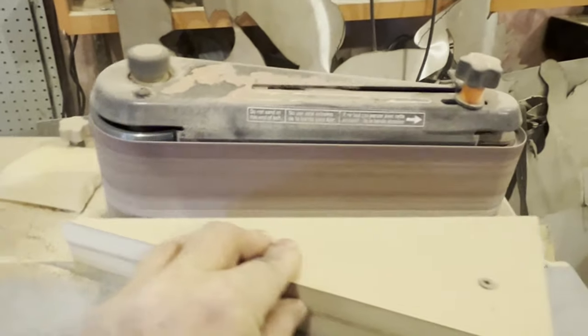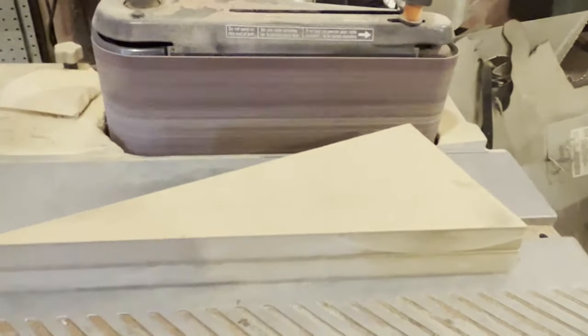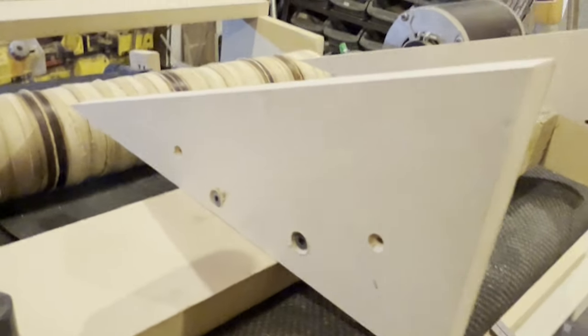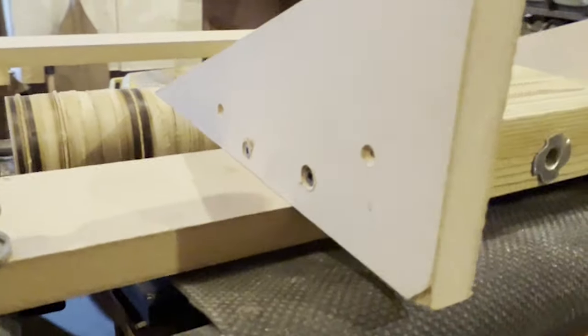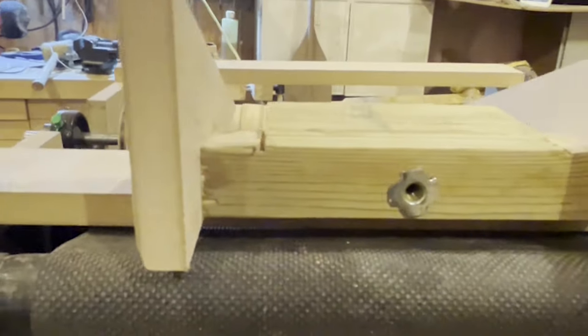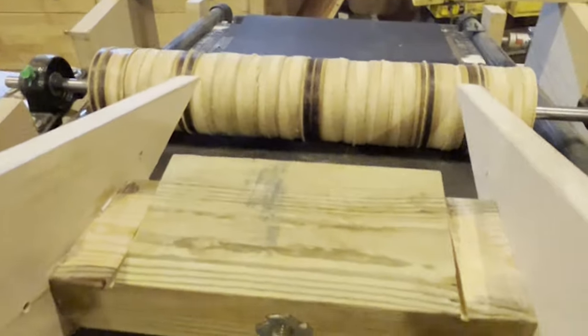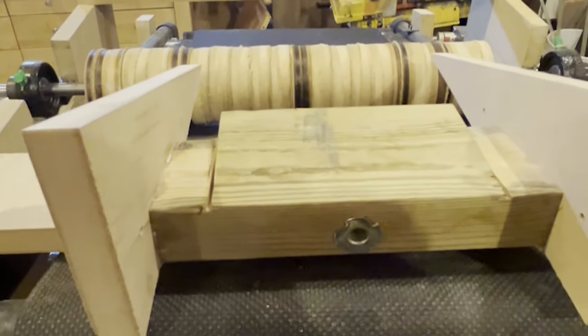Okay, now that I got it all set up, I have a better idea what size wedges I needed to lift them. So the ones that were in there, my testers, have come out. And so I've cut two here and I've screwed them together so that when I do the sanding off, everything ends up being exactly a perfect match. Because you don't want one side taller than the other, that's for sure. And there it is now screwed onto the new block with another hammer-in threaded nut. This time I drilled the hole a little bit bigger through the wood so it doesn't squeak.